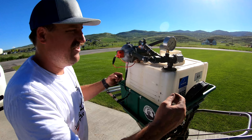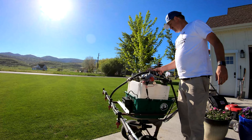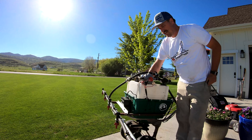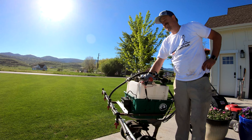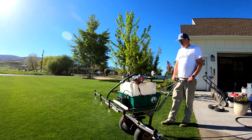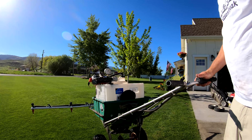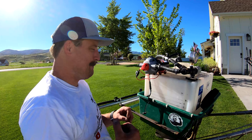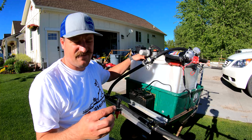Let's put some water in there and try it out. Oh, she's going — that's good. Turn the switch off. So it's ready to go. I'll fill this up with water and test it. That works — that's awesome. Oh, she just died on me. I wonder if I blew my fuse. Yep — it's a 7.5 amp fuse and it looks like I blew it, so I'm stepping up to a 15 amp fuse.